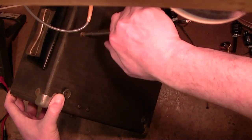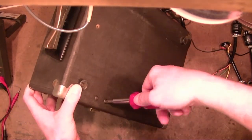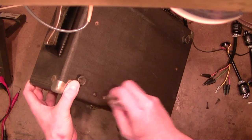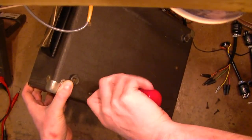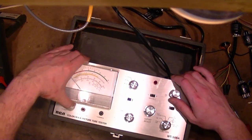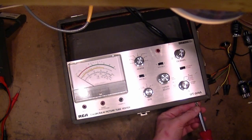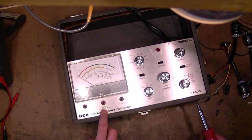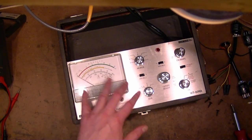There is another video on YouTube on this tester which I actually watched before I bid on it — I think Radio TV Phono Nuts had one of these and was trying to get it to work. I'm hoping this one will work as is, maybe just needing a simple recapping. The tester also has inputs for 1500 volts and 50,000 volts for use with a high-voltage probe, so it can be used just as a voltmeter with a suitable probe — it probably just has a resistor divider inside.